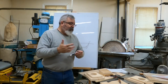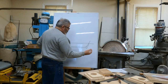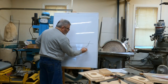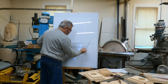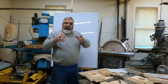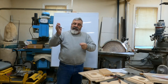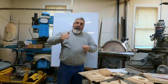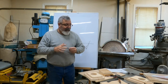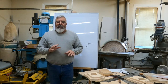There are things I've told you before too. I'm not going to do it on this, going to my own foundry. We're going to do only a couple. This helps with hard sand. A lot of times we'll put a little sand trap on the core print. It'll make a little indentation, and that way when the core goes down, especially with hard sand, if it scrapes the mold and sand goes down in the bottom of the mold, it goes down those sand traps instead. But that's for high production jobs.